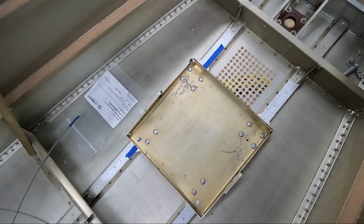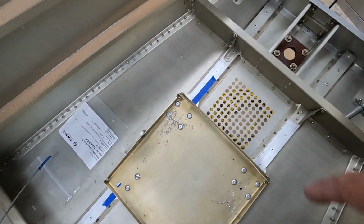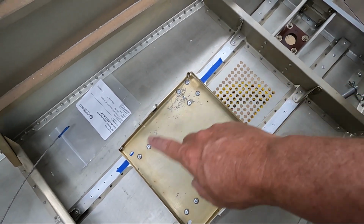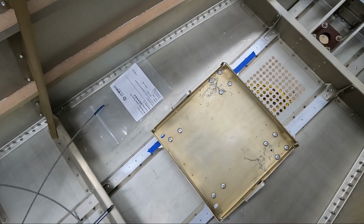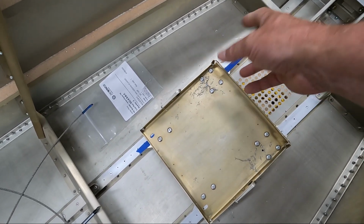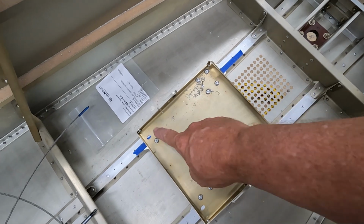What I did do right now is I put some blue tape on the pedal rails. I went ahead and measured in between the rivets that are on the pedal rails to find the center, and I marked, I think it's 4 or 5 spots in between the rivets that make the tray align with the holes that were made in here previously, at least on the back side, so that we can get the holes on the top here that need to be drilled in, since we're moving the retention point up to the top of the tray instead of the bottom.